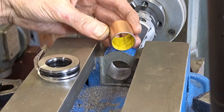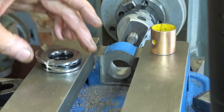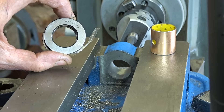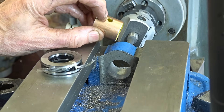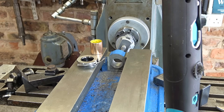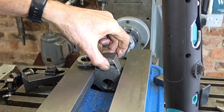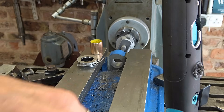Before I press this bush in, I'm going to machine this face flat for this bearing. The bearing is 42 outer, 25 inner. When I make my new screw, I'm going to make a step on the screw to take that 25 there. This bearing number is 81105 TN — I just chose it for size. I should say: before I bored that hole, I made sure that the threaded hole in the nut did actually line up with the hole. When this nut was manufactured they did get that lined up okay, because if it had been out I would have used this opportunity to correct it. But it seems fine.